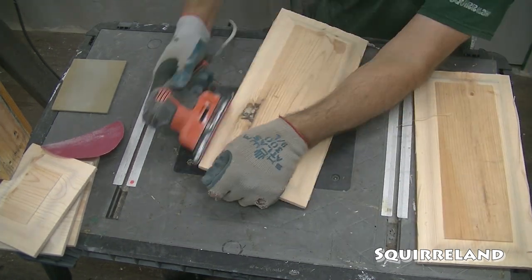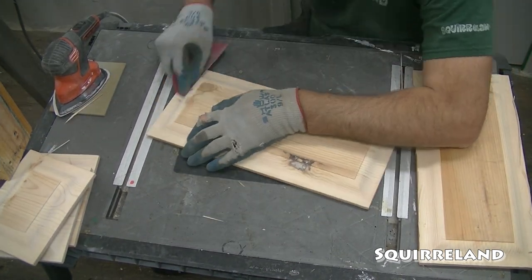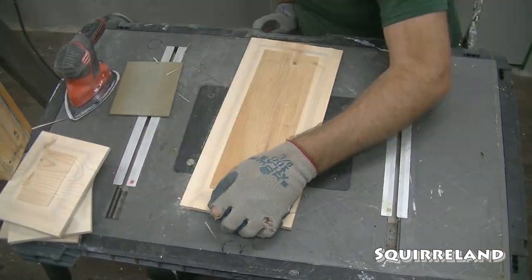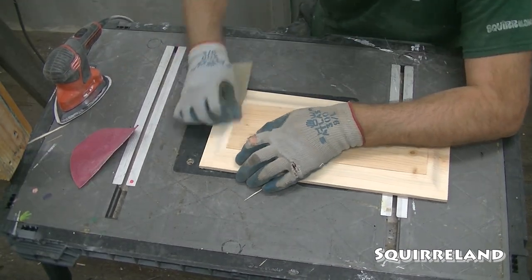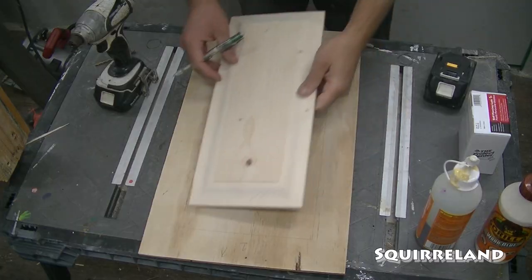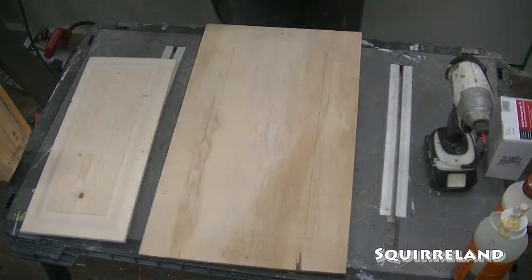In the past, I've found that wood stains highlight the swirls in the surface of the wood that get left behind by orbital sanders. That's why I'm going through and sanding everything by hand with a finer grit sandpaper and sanding pads. I also make sure to sand everything with the grain of the wood, as much as possible, to hopefully clean up any cross-grain sanding marks. With all of the sanding done, it's time to attach these decorative pieces to the sheets of plywood.